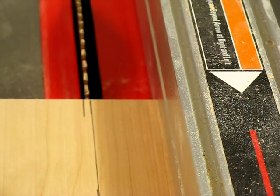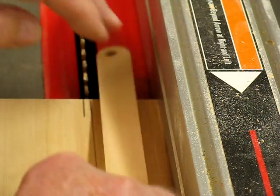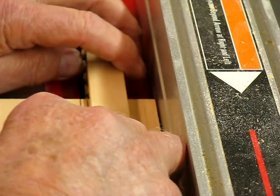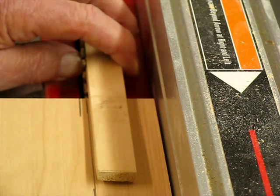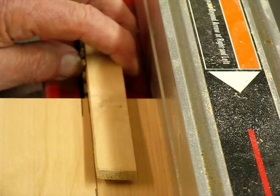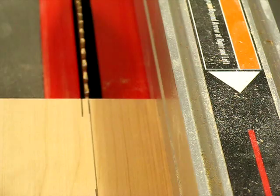See the mark on there? The long mark is where I want to cut. Remember the little trick I showed you with the stick — I want to lay that stick against the saw like so, and line things up so the line is just showing on the waste side of what we are cutting. We'll saw this off and then set this first piece aside.